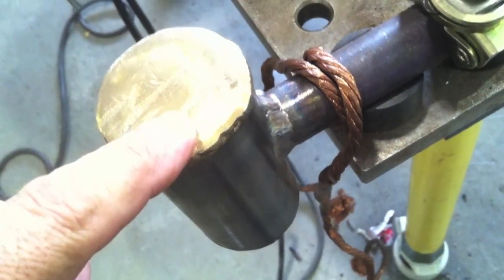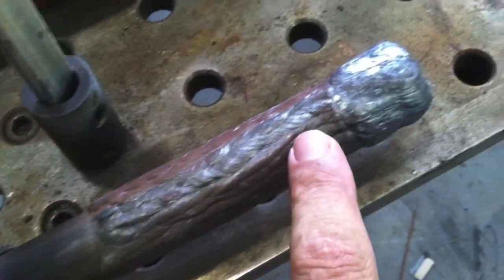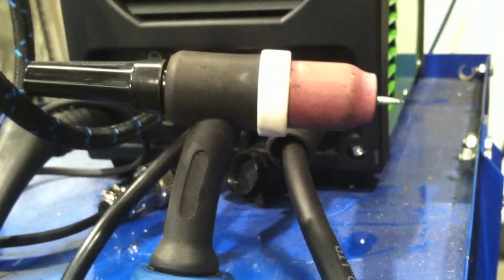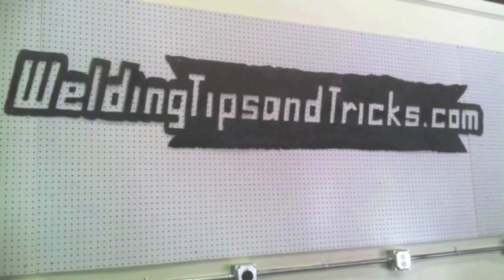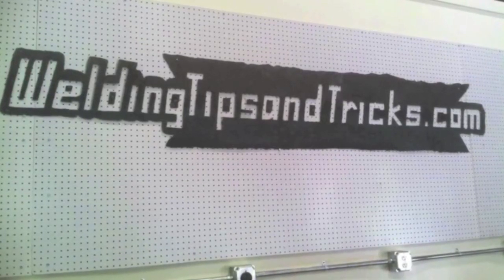So a little review: 309 for welding the one-inch to two-inch big part, a little silicon bronze on the face using Lincoln Excalibur rods to surface that with. I did it all using a gas lens setup with a CK stubby nozzle kit and this Everlast less-than-$500 Stick/TIG/High Frequency welder, which is pretty awesome. Thanks for watching — visit WeldingTipsAndTricks.com.